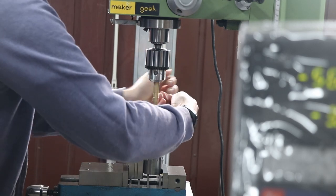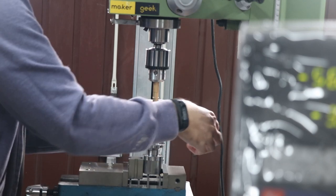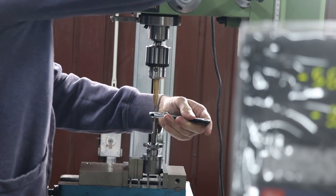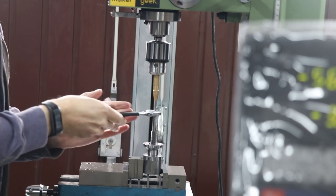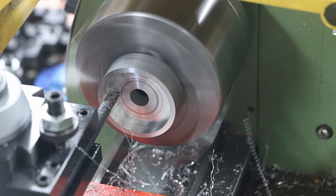Here I'm tapping - it's a pretty large thread size to tap actually. I tried using a sprung metal punch as a kind of poor man's tap follower and it sort of worked, but it was a bit wobbly at that distance, so I did end up making my own which I think we'll see later.